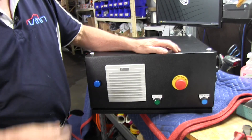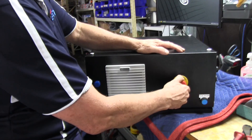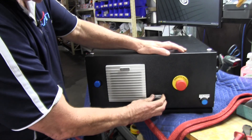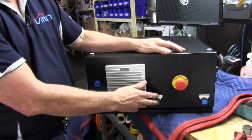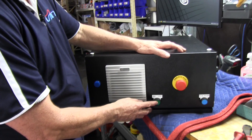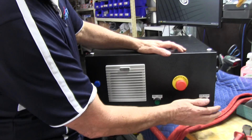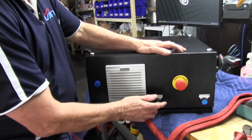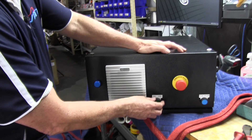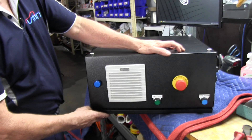I've designed this so that it will be basically the operator's control panel. There'll be a single e-stop here to stop the machine, which will trigger the safety relay — you need to disengage the e-stop and press the trigger. Then two more buttons which I like: a run/step button and a pause/resume. When running a program, hitting run starts it; hitting pause pauses it until you press resume, and while paused you can step through the program one click at a time.